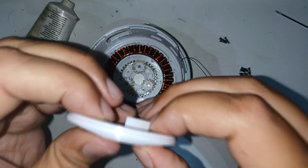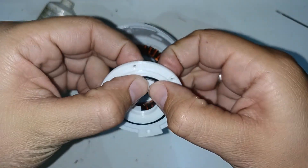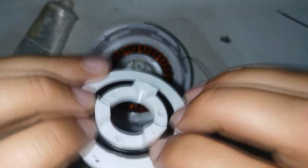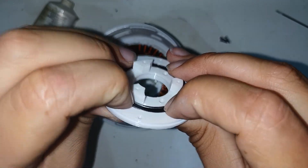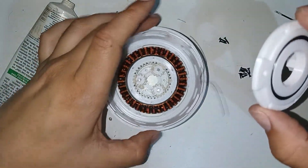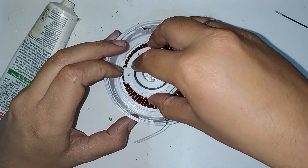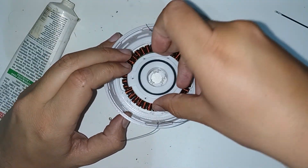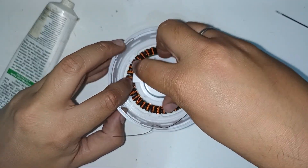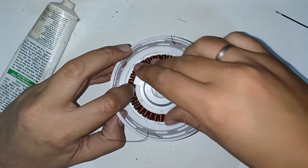The actuator has very tight tolerances for both 3D printing and assembly. I tried several 3D printing materials such as PETG, nylon, or polycarbonate, but all of them are less rigid than PLA. That is why I have chosen this material as the definitive one. It is probable that in the future I will try ASA if I need to hold more temperature, but at the moment the actuators are working without mishaps in the quadruped robot.